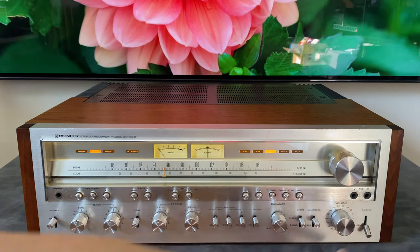These are all the capacitors and transistors that were removed either because they are known troublemakers or they have already become out of spec. A capacitor like this, for example, probably tested fine for ESR, but the microfarad value had probably crept up way above the 20% tolerance. These little orange guys tend to go high ESR fairly quick, and these are right in the signal path. So at 2.2 microfarad, these all get replaced with film caps, which test near perfect. And then these tantalums, these little blue guys, are really good caps, but when they fail, they fail badly. They don't have a good failure mode. So these often get replaced depending on which circuit they're in.